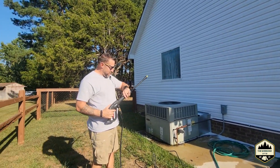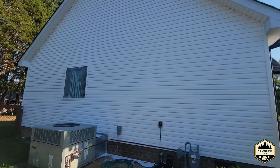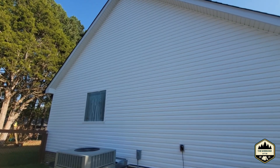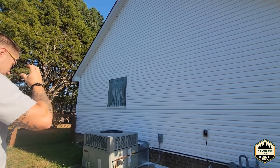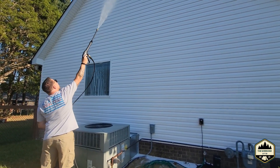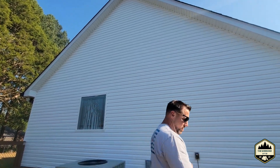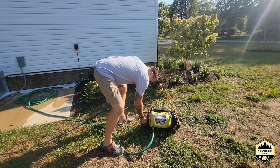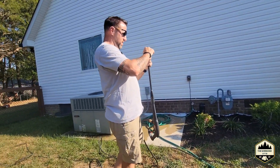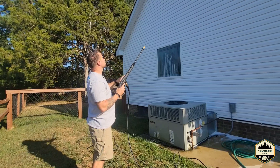We're back — it's only been about five minutes and I haven't rinsed it yet at all. Show me the house, Emma. I don't know if y'all can see that, but that stuff all washed away on its own! I just need to rinse it now to get all the soap off. I'm going to put in a 15-degree nozzle — I'm not trying to hit the siding hard, just doing it to rinse the soap off.